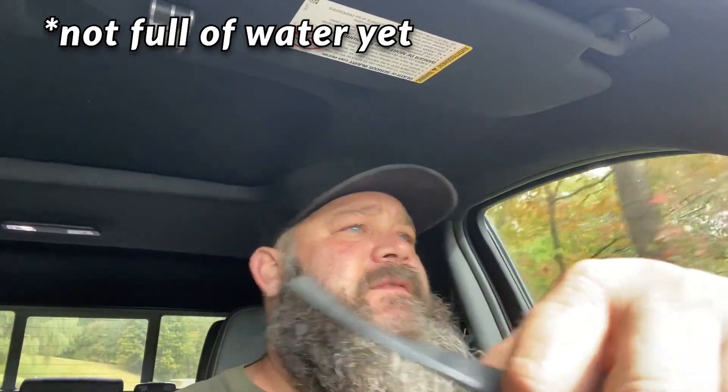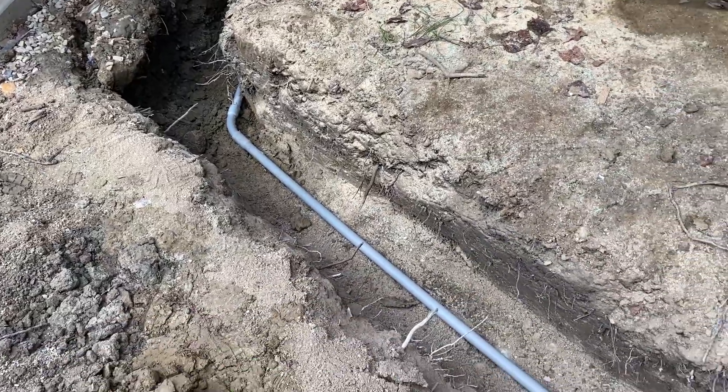We're not ready to use the water yet, but if you have an underground tank — I don't care if it's plastic or even concrete — when it's full of air it has the potential to float. So we want to get this tank full of water and take advantage of the next five days of rain, so we don't come back in a few weeks for another build trip and find that it's floated up out of the ground.